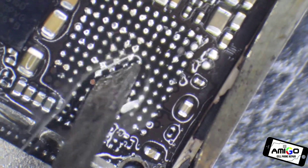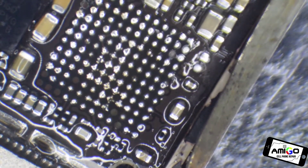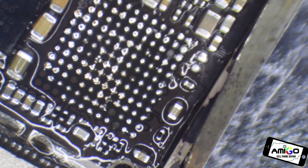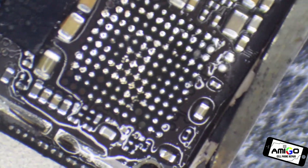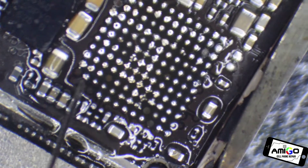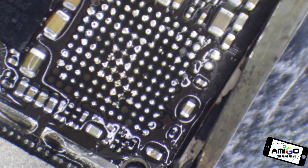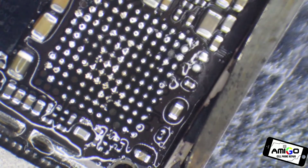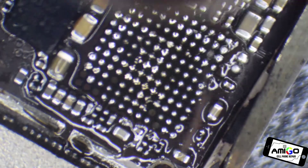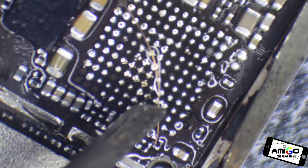I believe it's the type of solder that Apple started using — the manufacturers started using — to make stronger joins. But they have too many cold solder joints, and that is causing this problem. When I was removing all this, this one is the main problem. Only by removing them — this is so weak that it came off instantly. There is nothing there — that is the perfect sample. Now what we have to do is create a jumper, which is very simple to do on this device.